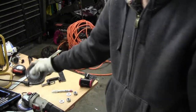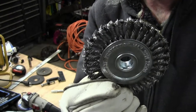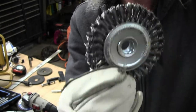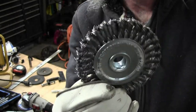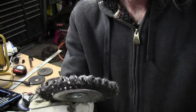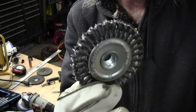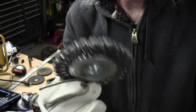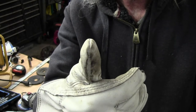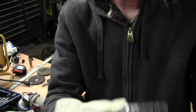when I go into heavy paint removal, I'll use this guy. But this one, I know everybody calls the cutoff wheels the spinning wheels of death. These suckers, you got to be very, very, very careful with. If they catch anything, this sucker's coming back at you. So when you see me cutting a lot of paint or anything like that, I'll use this or heavy rust. But again, when you watch me use this, my finger is on that button. I'm standing away from it because, yeah, this sucker will get you.